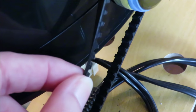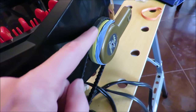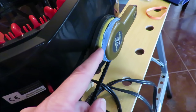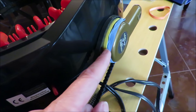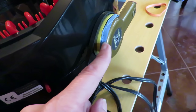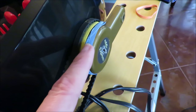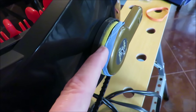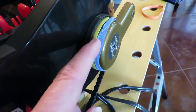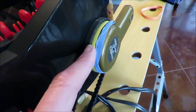When I first began this process, I didn't have rubber bands on here and the belt would slip on the slick plastic. So I first added yellow rubber bands to create friction, but they wouldn't stay put. So I added another rubber band around it twice — it's okay if it twists — to get it really tight, and that now keeps the yellow one from inching over, which was a very frustrating problem.